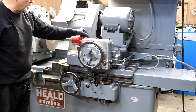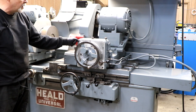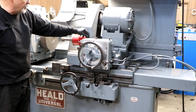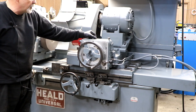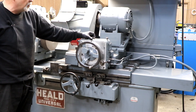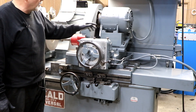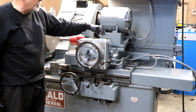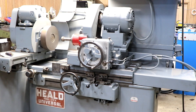It restricts how big of a feed you can make. So if you're afraid some of your operators are going to take too much material off, you can adjust this knob here so you can only take so much off without having to open it up further. This is a dead stop here — it slides in and out and it's a solid half-inch steel pin that comes up against a stop on the other end of that wheel. This is to set yourself up with feeding on the left and right side, or feeding only on the outside stroke.